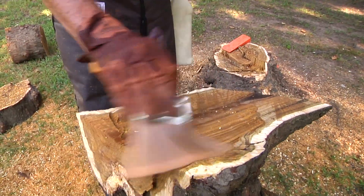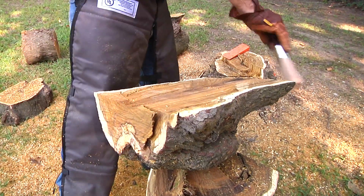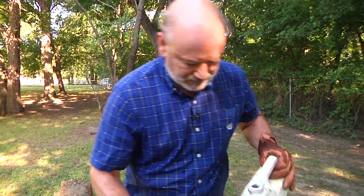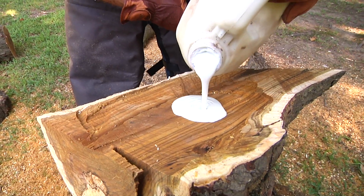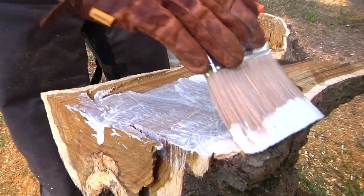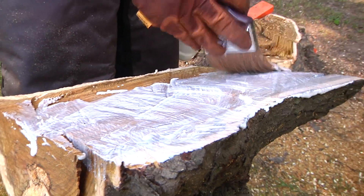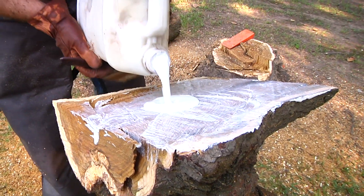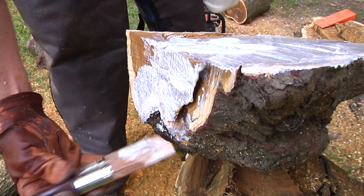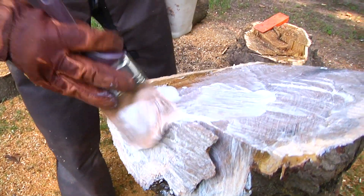I'm trying to get as much of the shavings out of my irregular chainsaw cuts as I can, because the sawdust in there will keep the sealer from sealing. This is Anchor Seal — the Northeastern Oklahoma Woodturners Association, which I'm a member of, buys this in 55-gallon drums and breaks it up to sell at a better price. It's thick stuff — it looks like thick latex paint but it's much better than latex; it has more ability to flex and soak in at the same time. Normally you don't do the side grain, but since I want to keep this burl safe as long as I can, I'm going to cover anything I uncovered. The end grain is the most important part — soak that on really nice and thick. You can see how punky it is in spots; it's going to soak it up. I'll probably put two or three coats on this.